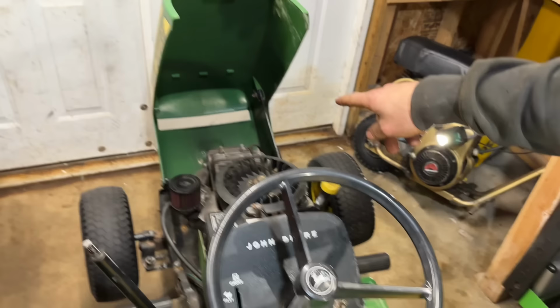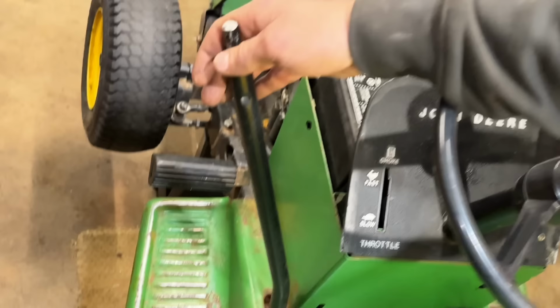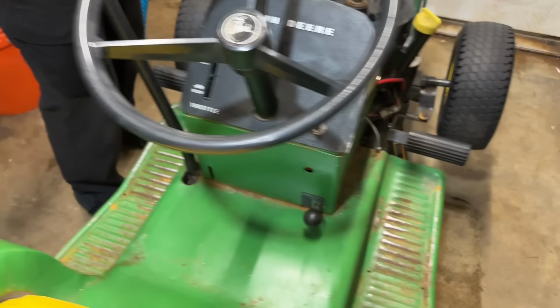We don't have the throttle here anymore because on the right side, that's going to be our gas. We got the clutch on the left. This deck lift is now the e-brake, and the shifter's back here on the side. The clutch pedal is stock. The gas used to be the brake, and we just hooked up a throttle cable there.